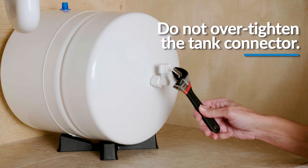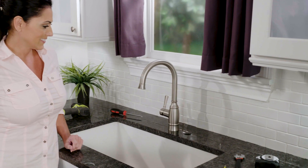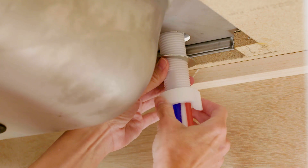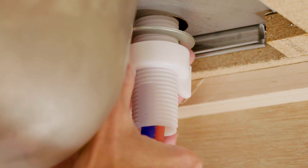But do not use a wrench, cross thread, or over tighten. Once you have a sink top hole measuring one and a quarter inches in diameter, make sure all tubing is inserted through the hole without any restrictions. Then, insert the metal washer back up the tubing and begin to tighten the faucet to the sink base by hand tightening the faucet nut. Make sure to not over tighten as you will damage and strip the threads of the faucet.